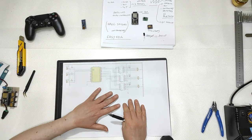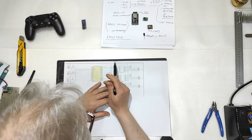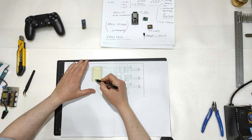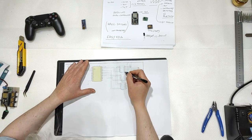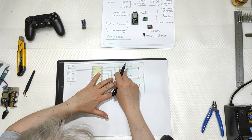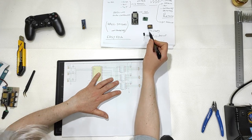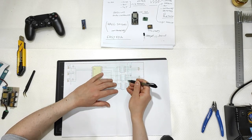With all the connections to the pins, I decided where to place the pins. I will not get into the system, but the main component is the ESP32 you have here. It has 38 pins, from 1 to 19 and the other way. I couldn't find a TMC 2209 stepper driver on Easy EDA, so I used a TMC 2208. It is his brother, a lesser version of the TMC 2209, but with the exact same pins connected.